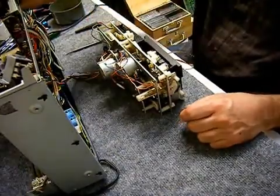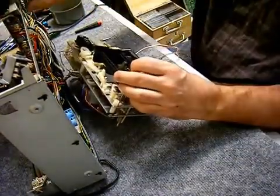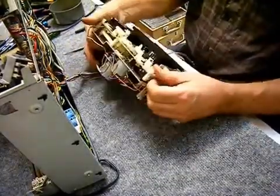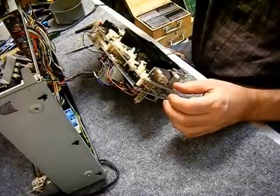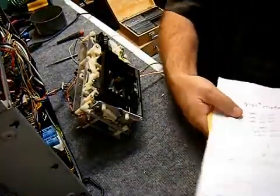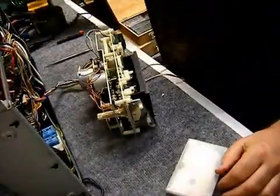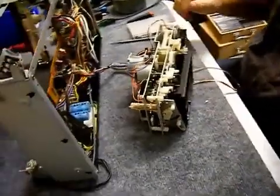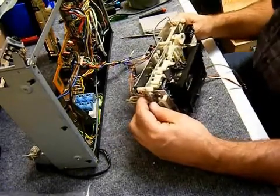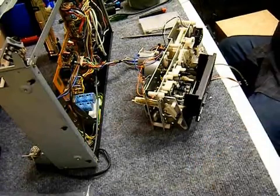At this point I notice I had forgotten to put the belt in place for the mode motor — between the mode motor and cam. You can see things moving around, so that's a good sign. Testing fast forward, rewind, and play. Things are looking good.